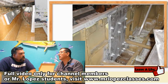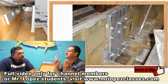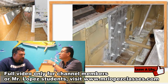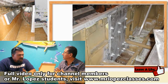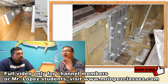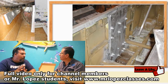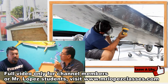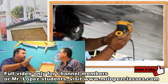In some situations, you need to put in a sandwich of pieces of metal. What metal is recommended to be laminated with fiberglass? It would be stainless steel, series 300. Aluminum alloy 5000 series you can use too — those are the most common. When you apply resin over stainless steel, it's a good idea to sand it and remove the chromium oxide in order to get more adhesion. The same with aluminum — sand it to create a good bonding surface. De-wax it because you want fresh material so the new material bonds properly.